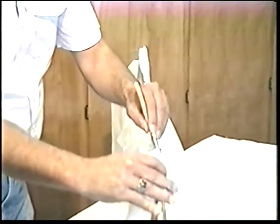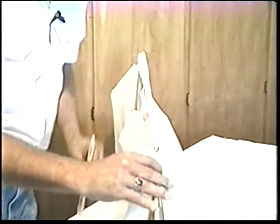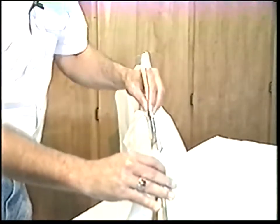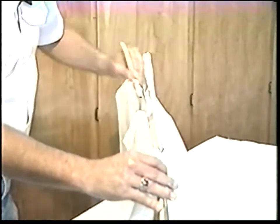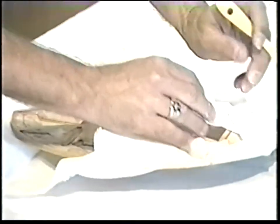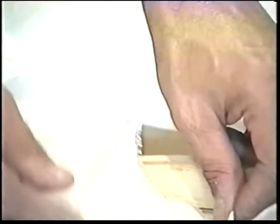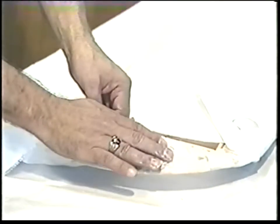Being a scale aircraft, we have a concave area where the aileron fits inside the wing. What we're going to do is cement this with the PolyTac and then work the fabric into it really well so that we have PolyTac all along the inside of this concave curve. If you're doing a corsair bent-wing corsair, inside the bend on the wing you want to do the same thing — just cement it down well any place that you don't want the heat to stretch it straight across a compound curve. On a wing tip such as this, we apply the fabric with the PolyTac cement, and with just a gentle pull the wrinkles come right out. This stuff works very well around compound curves.